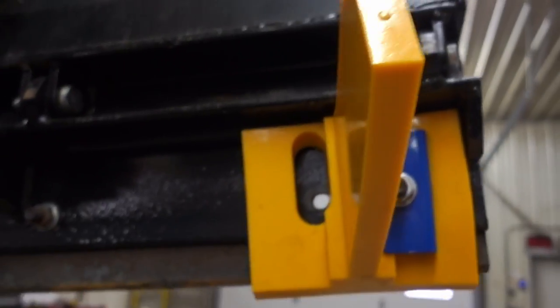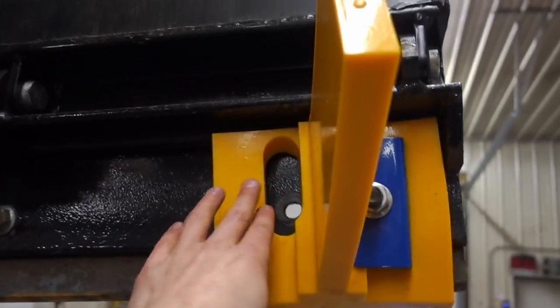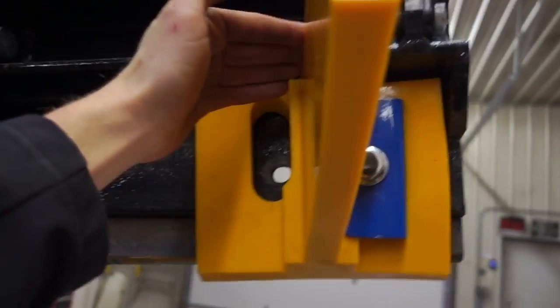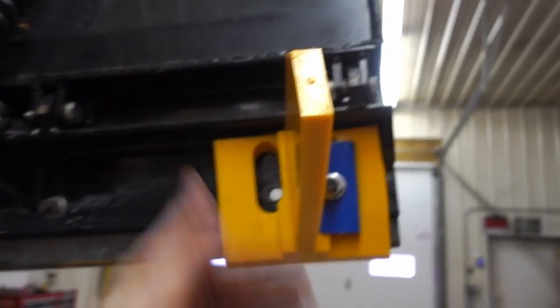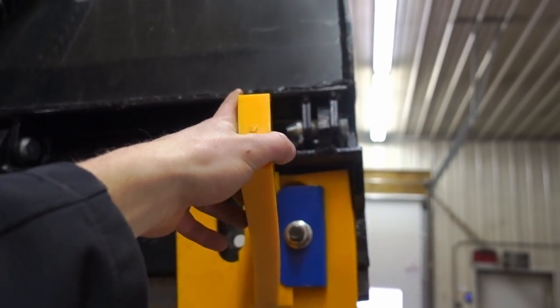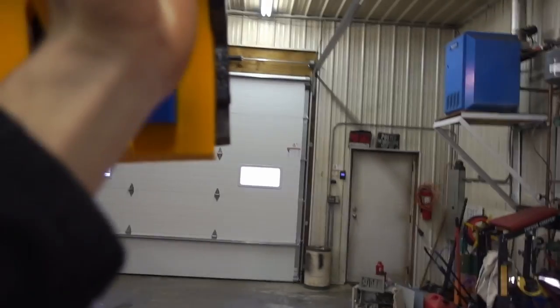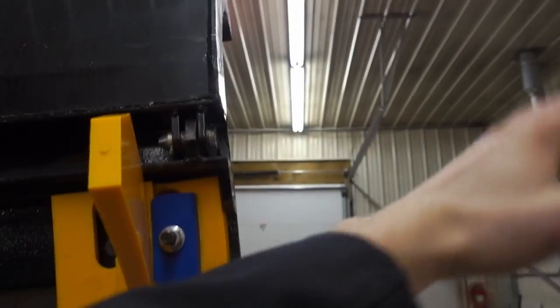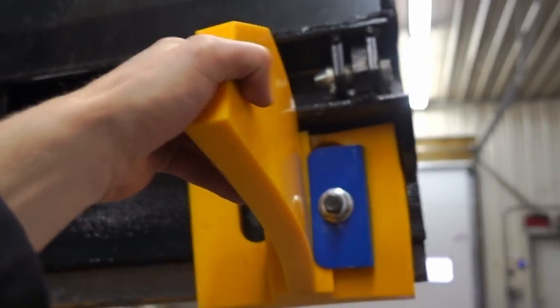You can see here we've got quite a ways because of our cutting edge wear. Here's the deal — I've got one side tight and not the other, so it's pulling a little crooked. But what this is going to do is any snow you're back dragging is going to be contained by this. And then when you go up against a curb with this thing angled, the curb's going to come along at an angle like this, and this is also going to hit the curb, bend a little bit, and help push any snow above that curb to expose your curbs.